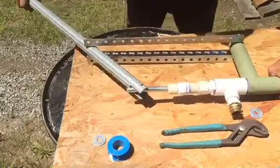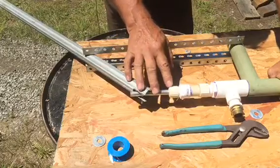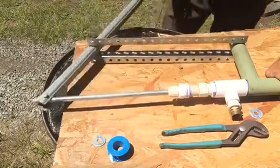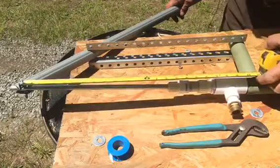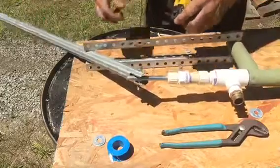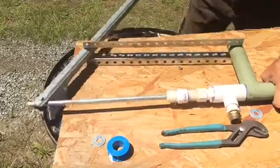And that's it. This way, when it goes totally down, we're still this far away. The piston in the bottom of the pump is not bottomed out. You're not going to damage anything, but then you'll get all the stroke you need right here. And if you measure this thing from there to there, it's 14 inches, less 3 inches, so you got about 11-inch stroke on this thing.